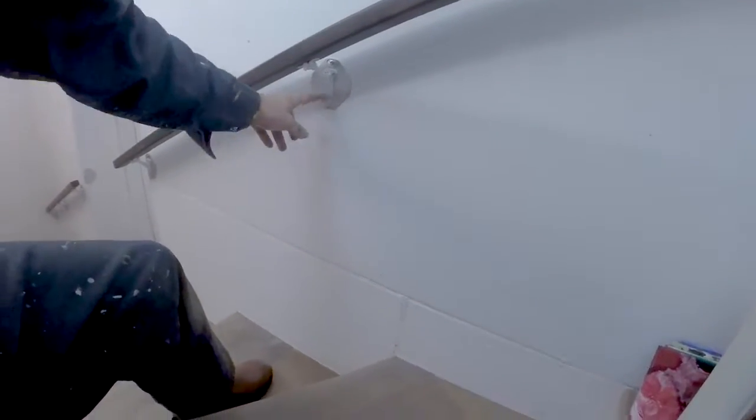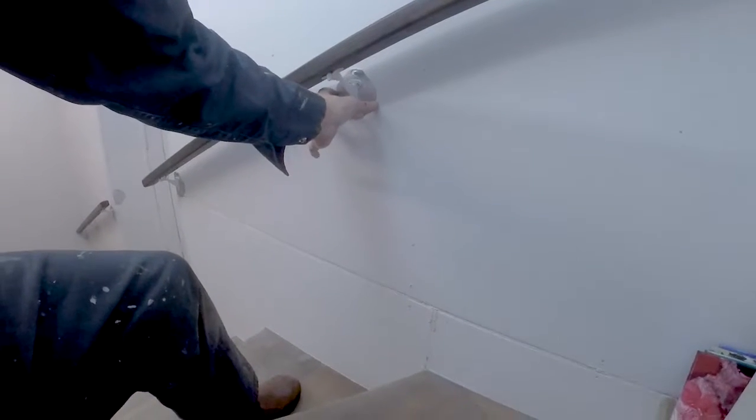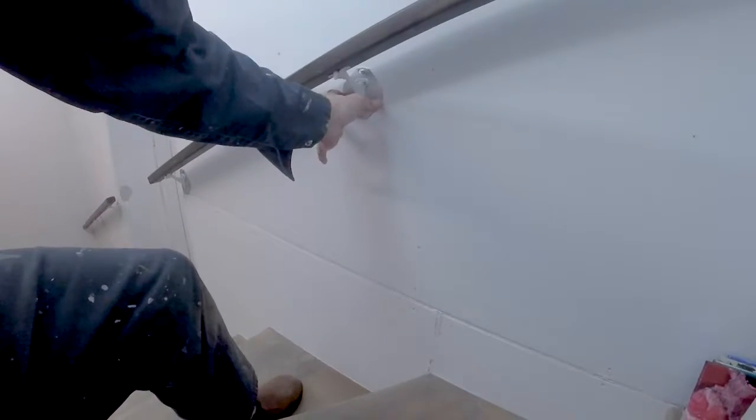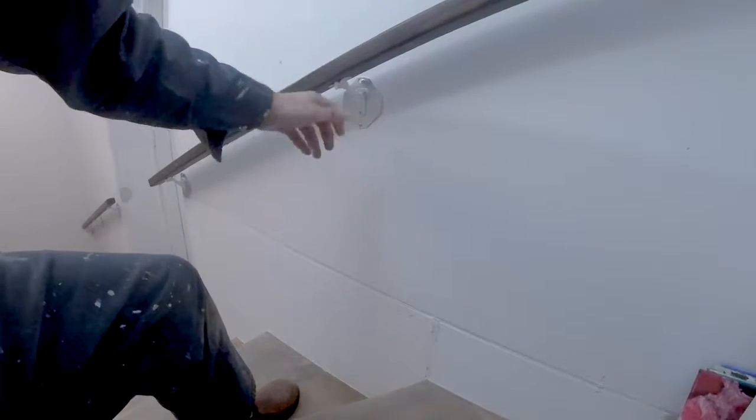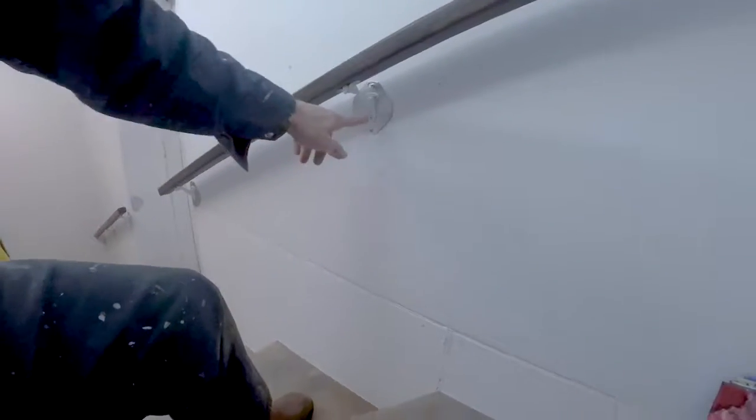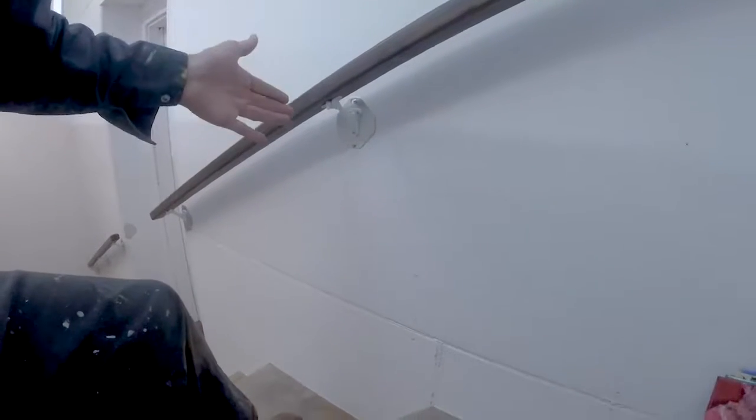The other thing of this is just the offsets. The only thing that we did with this was normally they'll put a little bit of a board or a piece of wood there, something that gives a little bit more grip, because that is just 5/8 drywall. So over time, pushing down, pulling up on that, these little thin metal brackets can crack the drywall. So they'll put a little wood medallion or something on there. And as we were looking through things, I saw the electricians had these little metal tops to some of their boxes. And so I said, hey guys, are you using those? And they said, no, we're going to return them. So I said, well, those are perfect for me to use for a medallion here.